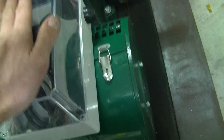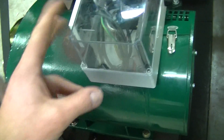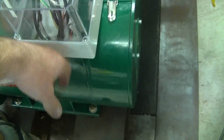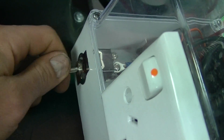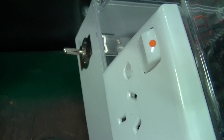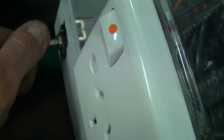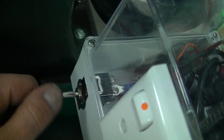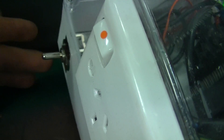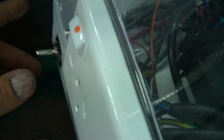I built my own little — I think they call it a dog box — which sits on top of the alternator. In here we've got a switch that turns on and off the field power. If that's in the off position, it won't generate any voltage at all. It's a handy way of turning on and off the output without having to flip a breaker or switch any LV or 240 volts.